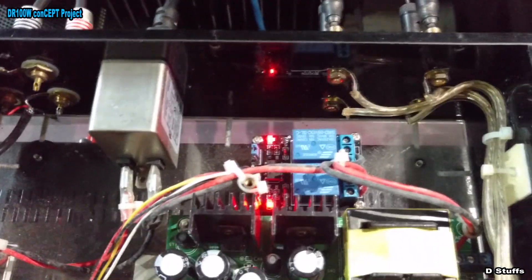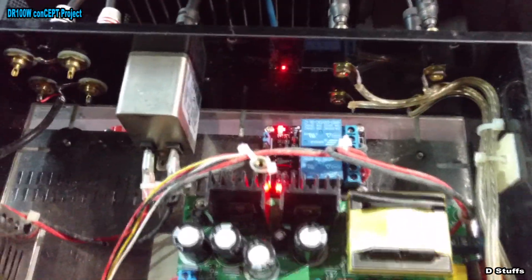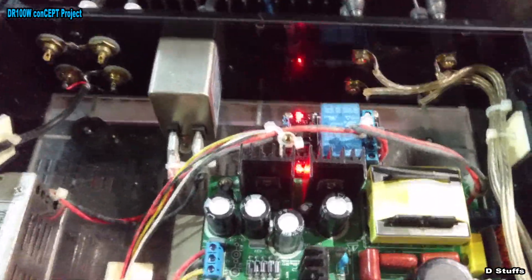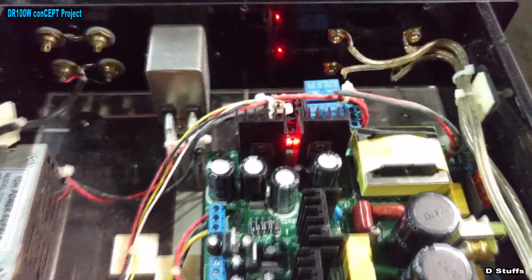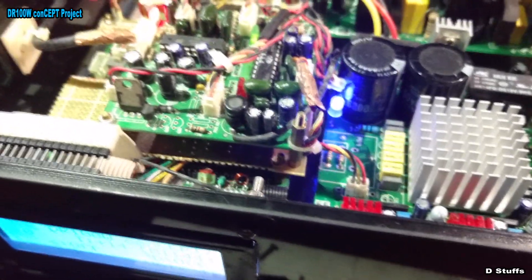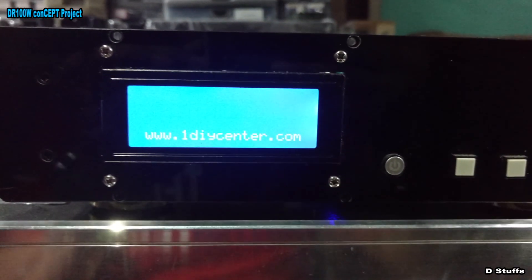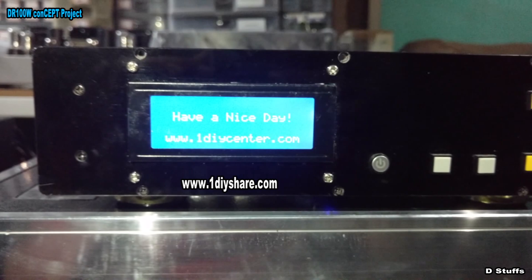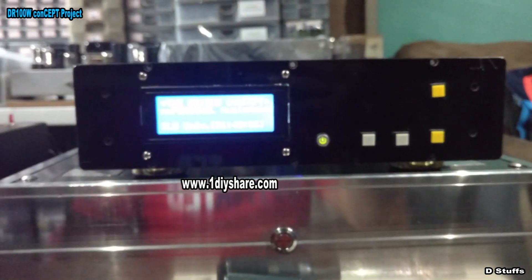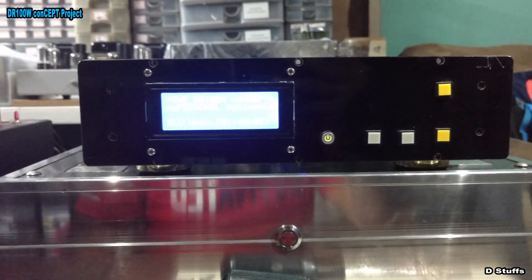This is the smooth power supply, and that is the AC control for controlling the 220 volts AC, so you can put it into standby mode and deep sleep mode. I cannot show you the controller, which is just below the tone control board. This LCD is programmed to turn off after five minutes to conserve power - that is the power management implementation.